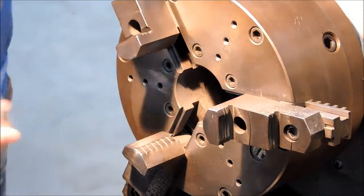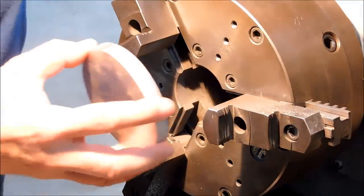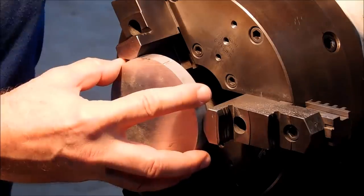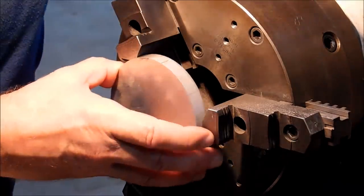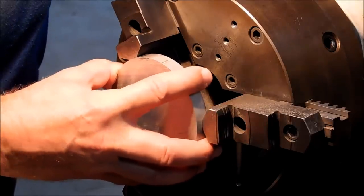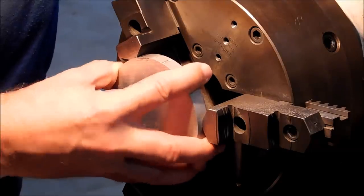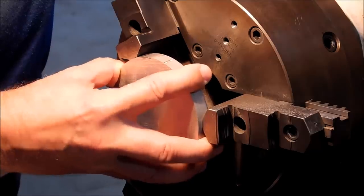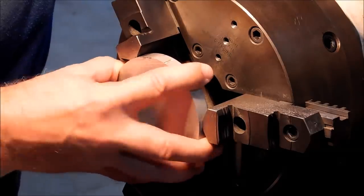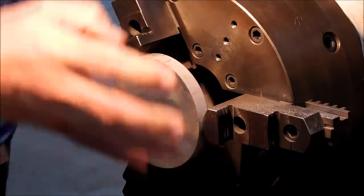Okay, let's prep the wheel blank. Whenever I do a job like this, I always deburr one side of the blank that I'm going to use when I stick it in the chuck. Move the blank around, roll it around in your hands until it finds a seat. If the saw cut isn't true, you don't want any hard stops in the original operations. When it stops clicking and moving, you are probably pretty close to where you want to be. All right, I like it.